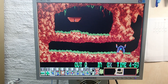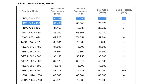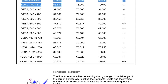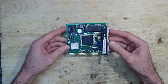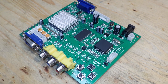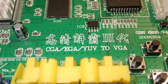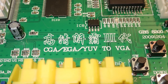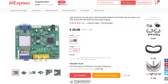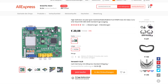However, in my workshop I have a Samsung TFT monitor which supports only VGA with horizontal sync above 31 kHz and vertical sync above 60 Hz. About one year ago I've been searching for a chip solution to be able at least to test the graphics cards, and I stumbled pretty fast over the very well-known GBS-8200 video converter, which was advertised to support CGA and EGA. It was a little unfortunate that it didn't say it supports MDA or Hercules, but I thought at least CGA and EGA could be covered using it. The GBS-8200 is extremely cheap at around 20 euros, so I ordered one from China and after a month of waiting it finally arrived.